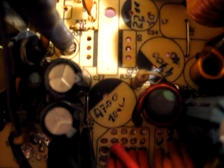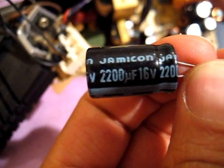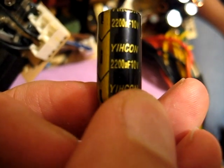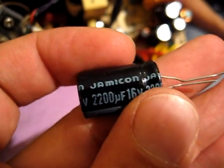The first thing to know: the 4700µF capacitor is broken and the 2200µF capacitor is broken. I've bought the 2200µF replacement but I must wait for the 4700µF as my shop didn't have it. This is simply - when you've done this two or three times it's as simple as a puzzle. This is the 2200µF from Jamicon with 16 volts. The old one was 2200µF at 10 volts - the capacity must be the same, that's very important. The new one with 16 volts is better.